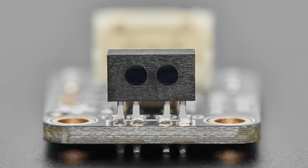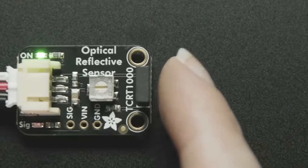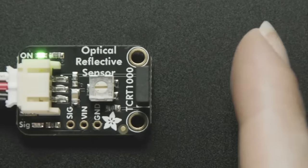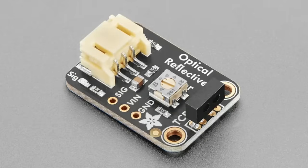It's basically an analog proximity/distance/obstruction sensor, good up to about 5mm. The reason I got this is that if you're measuring something rotating with a reflective metal strip and a small black Sharpie mark, it won't reflect off the black mark, so you'll know when it's spinning — great for detecting rotation. In the animation, there's a little red LED labeled 'signal': as you get closer the voltage from the reflected light changes, going down when something is nearby because it's a transistor.